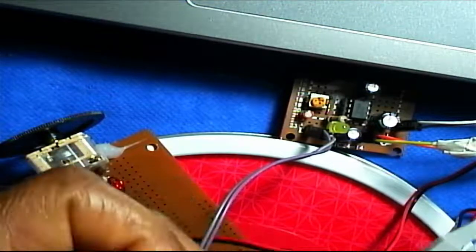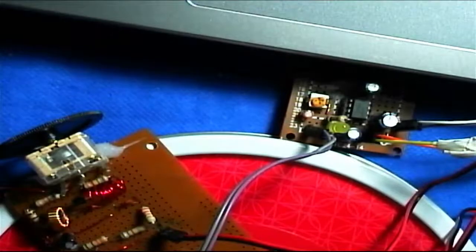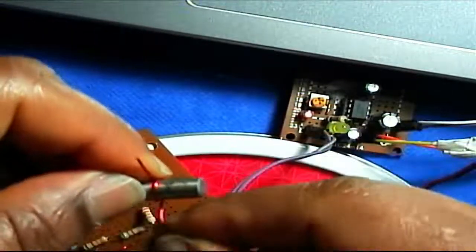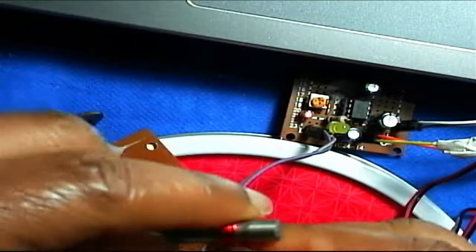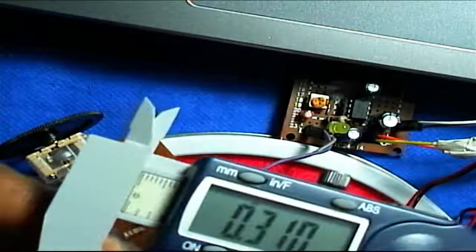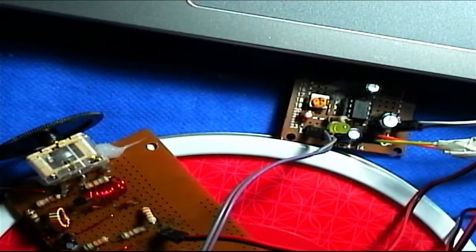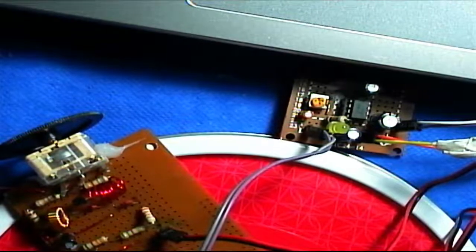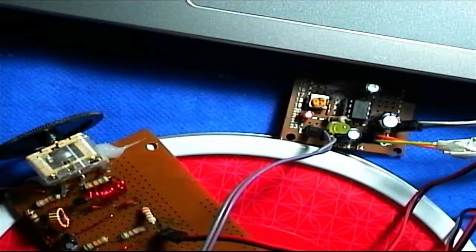If you have any enameled copper wire at home, take that wire and any drill bit. We'll do a bigger drill bit as well. This one measures 0.251 inches without wire. I'll put wire on it and wind it: one, two, three turns — we'll stop at three for now so we can measure and add more if needed.